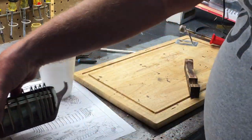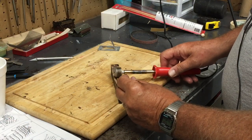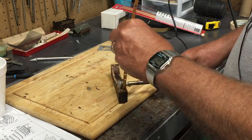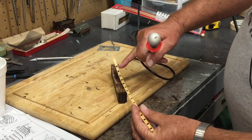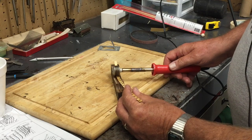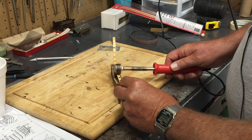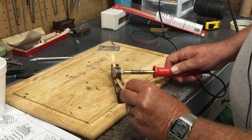Let me get this other side bent and glued on and continue. This is only soaked a few minutes. I've tried a few different methods of plank bending, and my favorite is the hot iron. But you do still have to be patient, especially if you're dealing with hardwood. When you're dealing with a real small crease like this, you cannot push down hard at all or you will snap it. So I'm really just resting this hot iron on that when I get to that point. This entire piece should have a slight curve to it, so I'll just kind of gently heat the whole thing and continue to try to get that curvature of the hull into it.